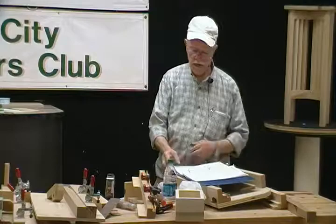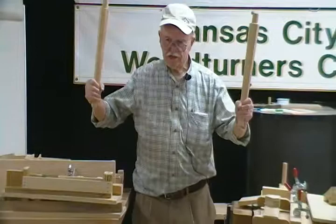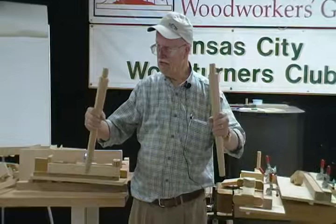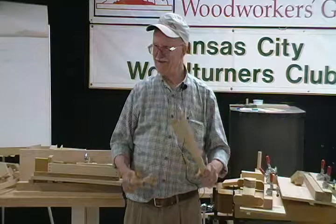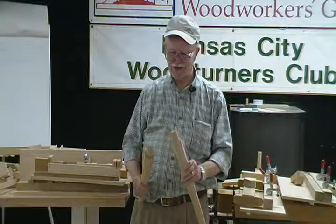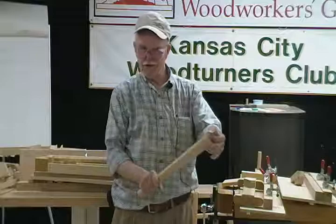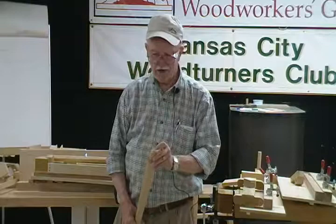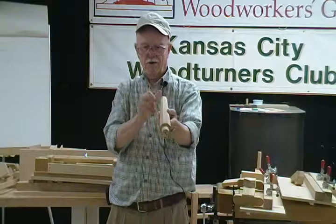I want to go to the eight-sided tapered legs, because this was part of the Andre's project. We made 70 chairs — 70 chairs times four legs times eight cuts per leg, plus turning a tenon on them. This is a rather tedious operation unless you know how to do it, and if you know how, it's very simple. The first thing we had to do is put this on the lathe and turn this tenon. That's really straightforward lathe work. Since we put it on the lathe, we had to drill a center hole in either end to suspend it on the lathe to turn this.